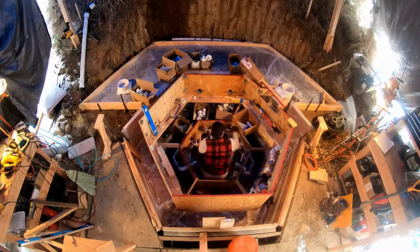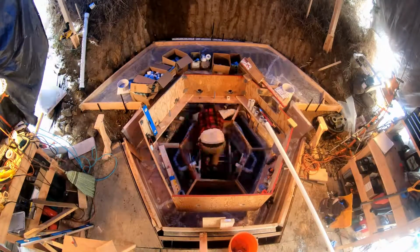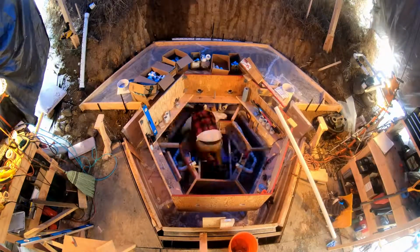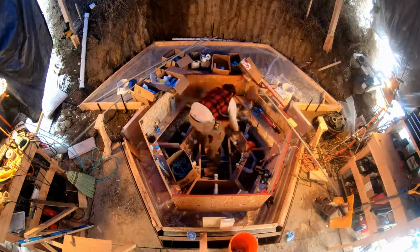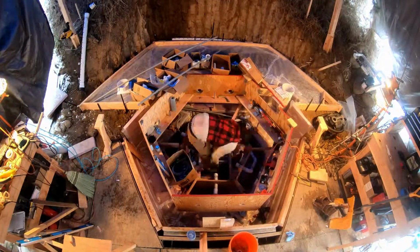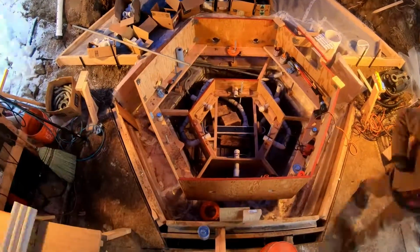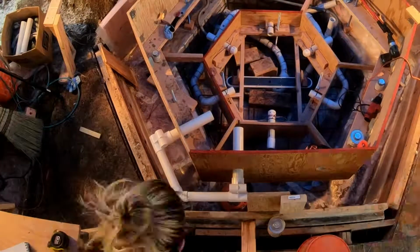The LED pool lights fit into a 1.5-inch threaded return fitting, and those in turn fit into a 2-inch PVC tubes that are bonded to the basic 3/4-inch PVC electrical conduit that runs back to the pump house. While finishing the electrical rough-in, I ran a pulling string through all the conduit to aid in fishing the wire. Finally, the lower plumbing was complete, and I could move on to test fitting and sizing the parts for the jet plumbing. I think that's enough for now.